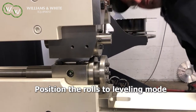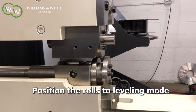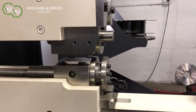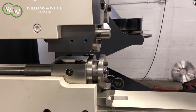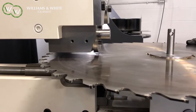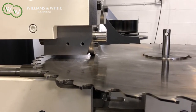As I press the top roll down, it's going to push the steel down into that gap — it acts just like a hammer but it's much more precise, and it acts equally all the way around the saw. It's going to be quicker and more accurate, and your saw life will increase. Instead of constantly hitting with different pressures, no matter how good we pretend we are with a hammer, we're much better off going around the saw with one precise, consistent level of pressure.